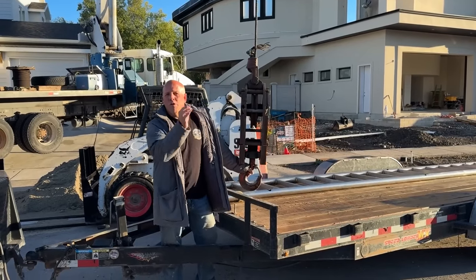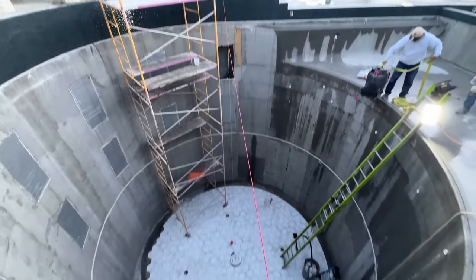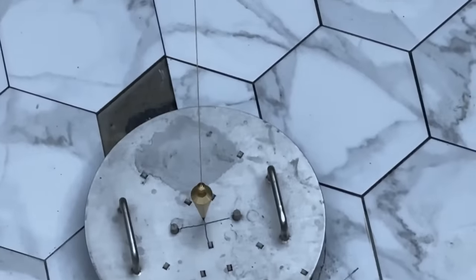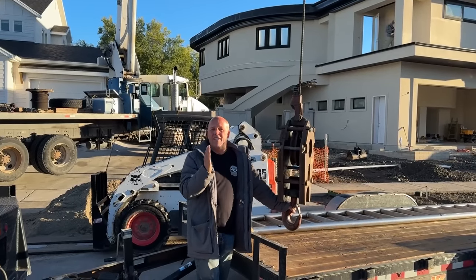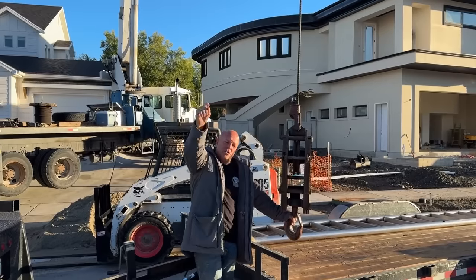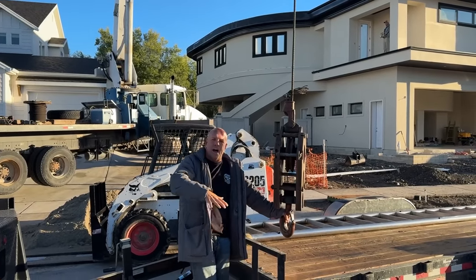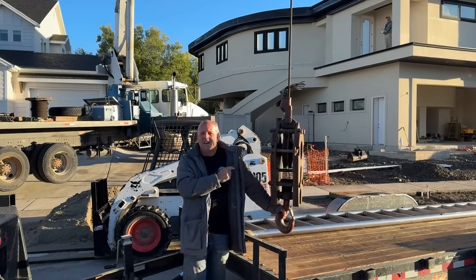Lines across the pool with plumb bobs down to the center of the main attach point of all the cables. That center stainless steel attachment that's in the concrete is absolutely perfect. So any imperfections in the pool walls that might be there, we have to base off of that, reference the ladder to that, and then two plumb bobs off the end. We've got to really true it up because the platform that goes up and down needs to stay perfect and it rides on these ladders.